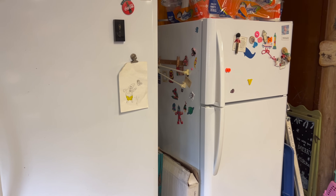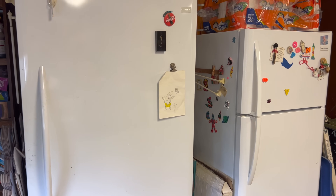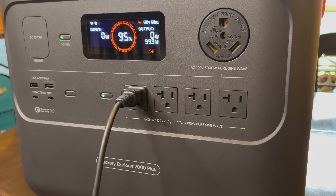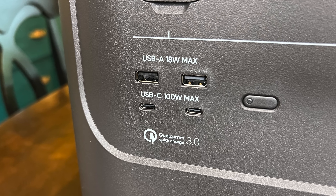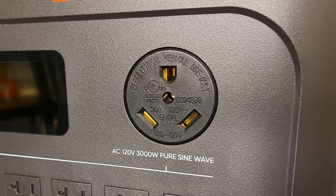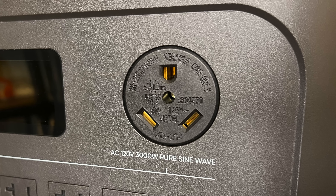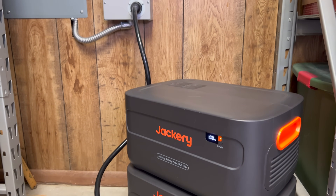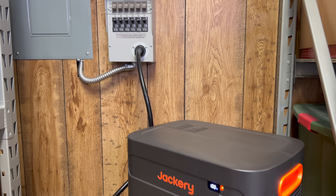That's quite a bit more than other devices I've tested that are similar in size to the 2000 Plus, and power like that is enough to handle multiple large appliances at the same time. If at any time you think you may want to check out the 2000 Plus or any other of Jackery's solar generators, be sure to use the links in the description below. When it comes to ports, the 2000 Plus has four 110–120 volt AC outlets, two USB-A ports, two USB-C ports, and a 12-volt car port. One of the things that makes this unit really impressive is that it also has a 25 amp plug, which will allow you to use it to power multiple circuits in your home using a transfer switch — I'll show you how that works later in the video.